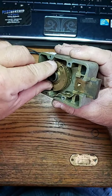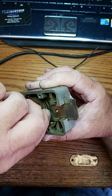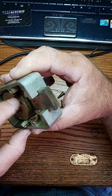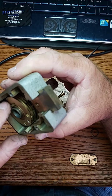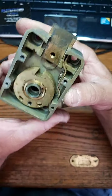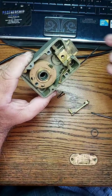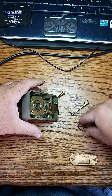We're going to pull the spring out for now. As the wheel pack turns, it pulls all the wheels — you can see the wheels in there. Once those wheels line up, I'll show you right here: there's the gap right there, you see that hole. We turn the wheels — one, two — there's the next wheel lined up. When you turn the dial back the other way, you get perfectly aligned wheels. This piece here then drops down into the gap; once it drops in, you turn the hand dial more, it pulls the bolt back, and boom — your safe lock is open.